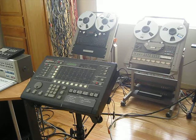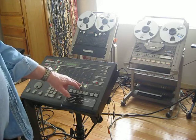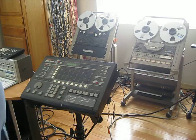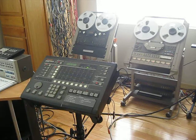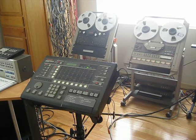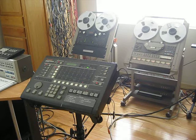After the time code is striped on there, the Midiizer, any time it's turned off or either drive is turned on and off, it needs to relearn what it's connected to. That's a very quick process. You set it into the command lineup, the setup command, hit enter, and the two drives will take off, educating the Midiizer as to where they are in their own respective time codes.